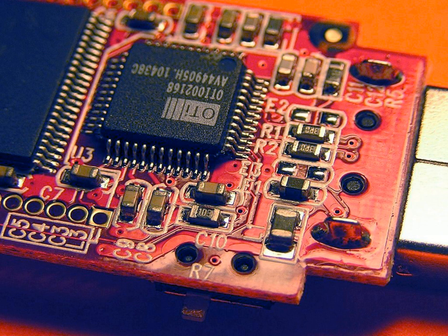Ceramic column grid array CCGA, a circuit package in which the input and output points are high-temperature solder cylinders or columns arranged in a grid pattern. The body of the component is ceramic. Micro ball grid array MUBGA, ball spacing less than 1 mm. Leadless package LLP, a package with metric pin distribution, 0.5 mm pitch.